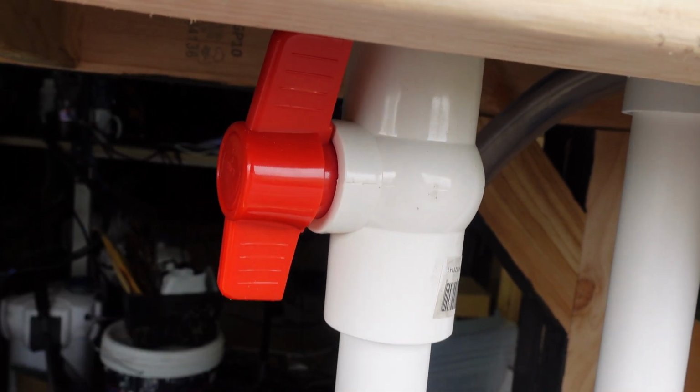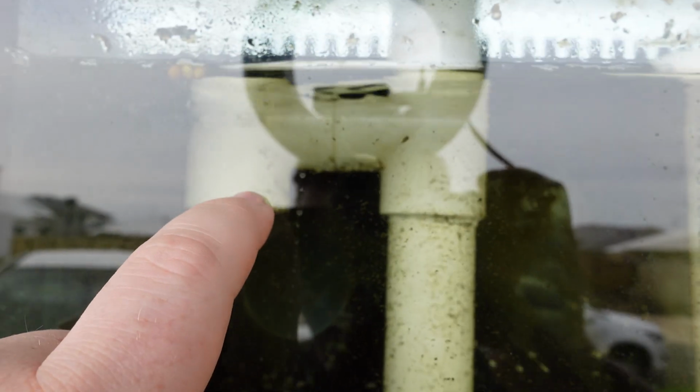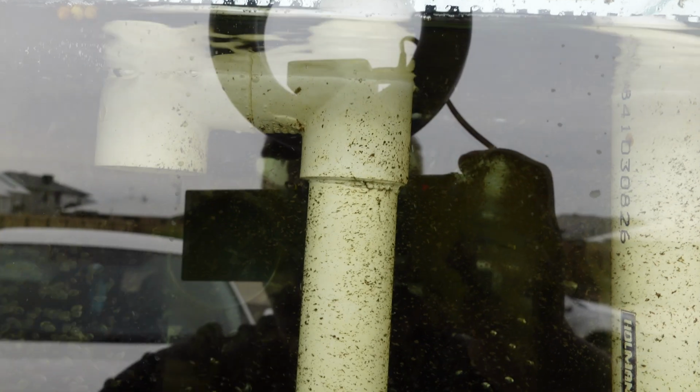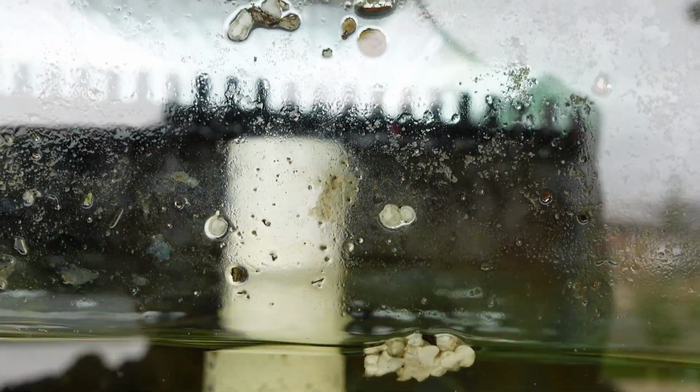So you go down to your tap here and you turn that down slightly so that even when this is under full siphon, the water level very, very slowly creeps up. And it creeps up and creeps up until it reaches this second overflow here, in which case it just slowly trickles down and goes straight down into the start of the sump there. In this third overflow, as I mentioned, you should never really see any water except in case of emergency.